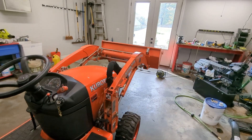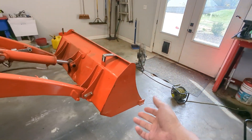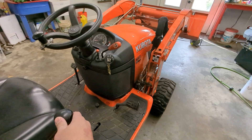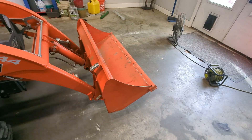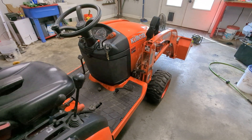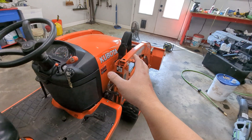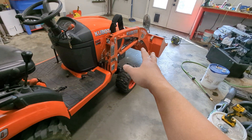The other thing — let's just curl this out here. On pretty much any tractor, if you curl the bucket to this extent and the machine is off, if you tried to curl it back it wouldn't curl back. Even if you lower the boom, it's not going to curl back because it doesn't have any pressure. Well, on this one, if you try to curl it back and then you actually let the boom down, as you can see, it's curled itself back magically. Those familiar with hydraulics may already know the answer to this. I'm making this video because I have not seen the answer put out anywhere — maybe it's common knowledge, but I thought it was interesting and wanted to share it.